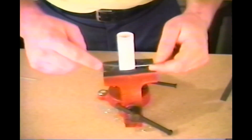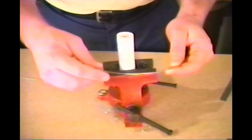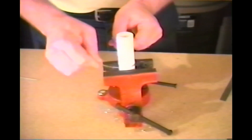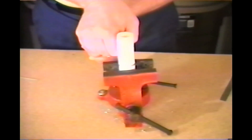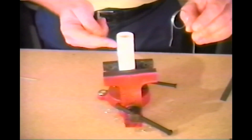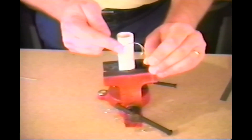To make a circular bend, find something that is a smaller diameter than the circle you want to bend and simply wrap your piece of wire around it. It's good to go about one and a half times around. The reason you need a diameter smaller than what you want to bend is because the wire will spring back open.